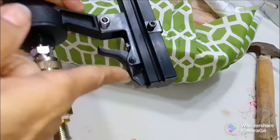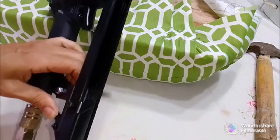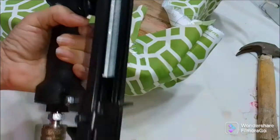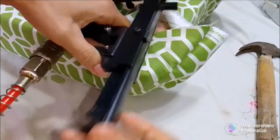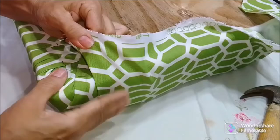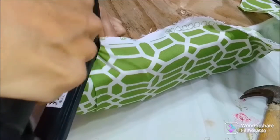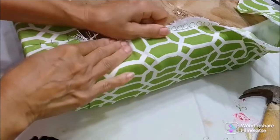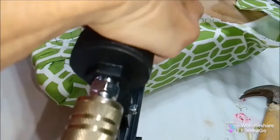Also be careful with the stapler. The staples are finished here so I am going to reload it — I'll show you how you load it. It has a protective hook on the side and you insert the staples in it. If you don't hook it back, it flips back out. That's why you have to secure it in place, and you do not aim this thing at your face because this sends out staples like crazy. Be mindful around air compressors and staple guns. When I am doing framing and so on, I have always wanted a miter saw, and that is a very handy tool that anyone — women or men — should get. It is very helpful when you are doing a lot of jobs that require neat mitering, to eliminate the stress of having to measure and cut at angles.